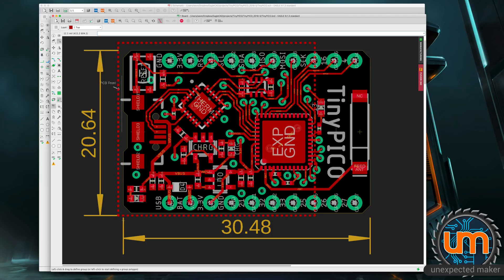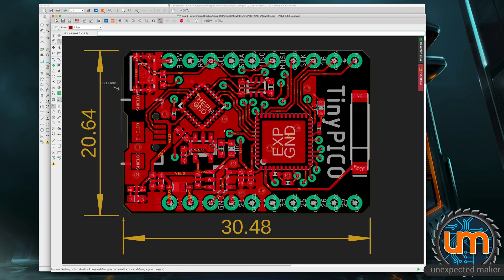As you can see, it's quite tight — there's a lot of stuff in here. There's a little bit of space, but in the context of the size of the board, it's not a lot at all. I need space here for ground connections. If I do a fill, you can see there are quite a few vias on ground connecting everything. It got very tight — it was definitely a challenge to route, and absolutely the biggest routing challenge I'd ever done because of the space constraints.